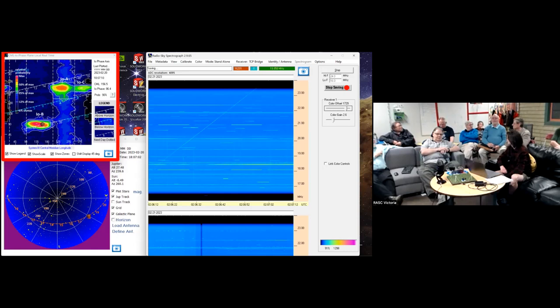Dipole lengths, right? You kind of reject a lot of them. Because you have the dipole lengths correct, you're going to be tuning to a fairly narrow frequency, by the nature of the antenna. Yeah, it's resonant at 21 megahertz. So you're rejecting a lot of the stuff that's off-frequency, so you won't be getting much of this.